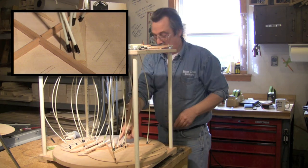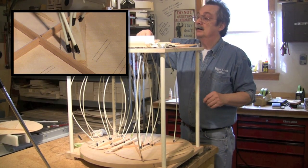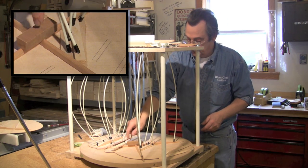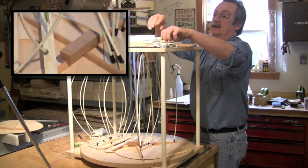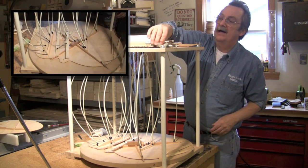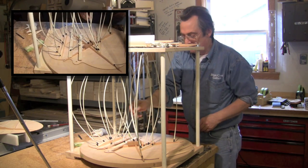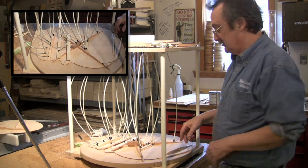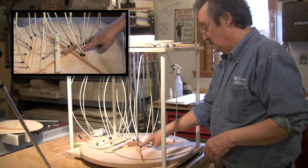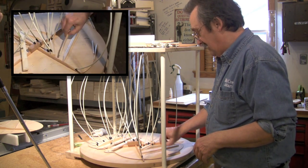Here at the center of my X, I want to put something right here — I'll put it across and now I can put two go bars on it. I have a couple of different sizes of go bars, which will come into use later in this series when we go to put the tops on. The X-braces and bridge plate are in — now we're going to put our tone bars. I have a short tone bar and a long tone bar.